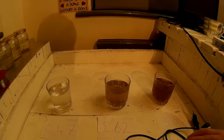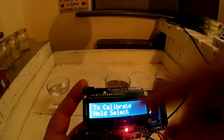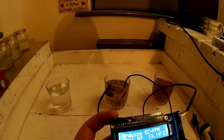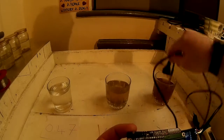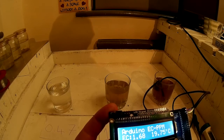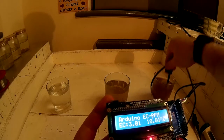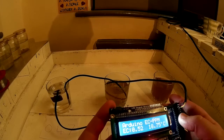Take your power and plug it into your Arduino. The startup routine tells you what it's doing, how to calibrate it, and how to navigate. Drop the temperature probe and the EC probe in. This is saying 1.57 — the reference is 1.62, so it's pretty close. The next one should change to 3.0 — it reads 3.01, almost spot on. And the far left solution should be about 0.47 — it reads 0.52, not too far off.